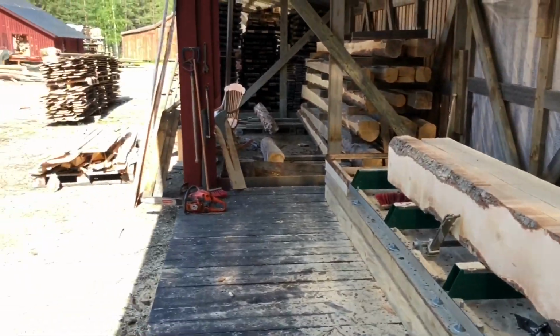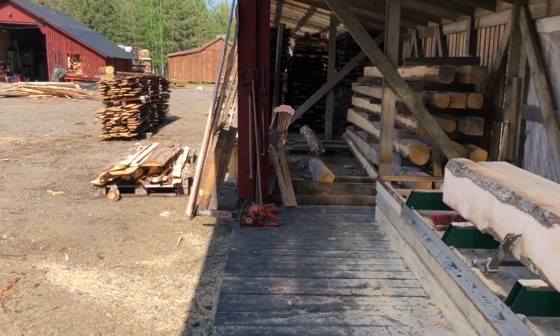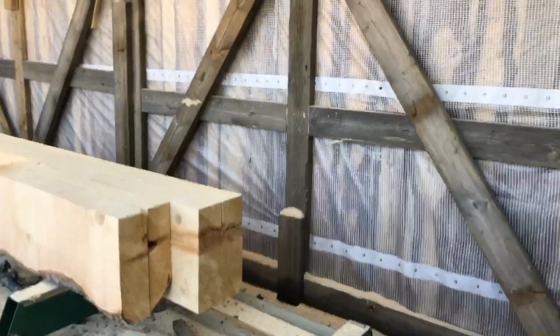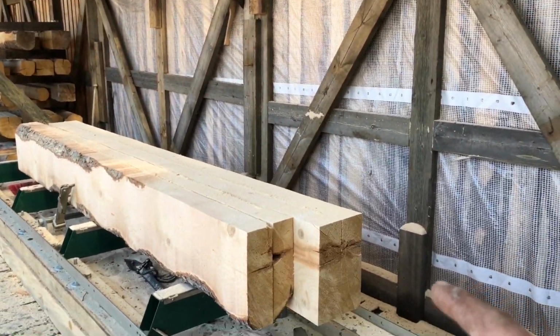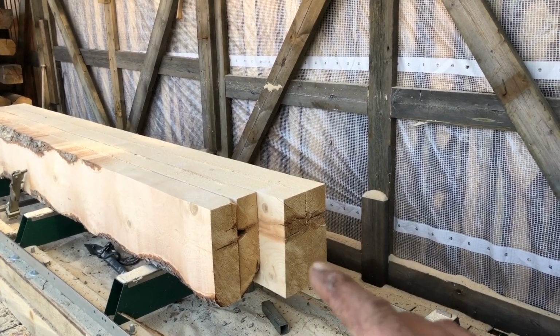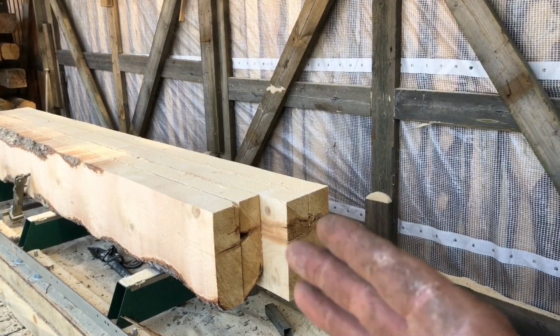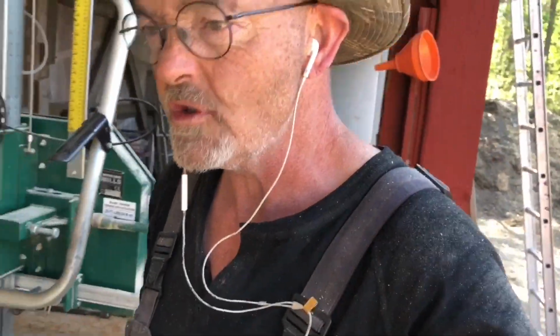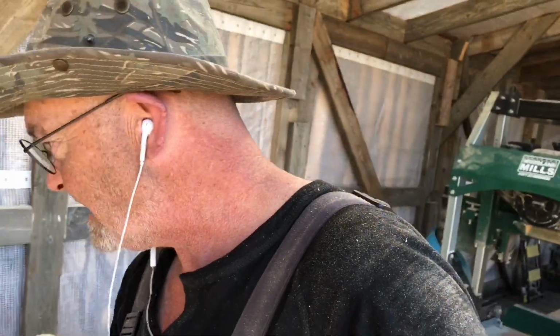We can just push this all the way up here out the way. And I'll cut all those down, producing 4 boards each pass. Now I don't mind stacking them like this when they're 4 inches or greater. But when you do the fine stuff and it does this, snap the blade, guaranteed to snap the blade. But I'll do it with these because it won't snap the blade.